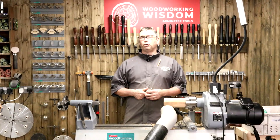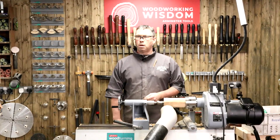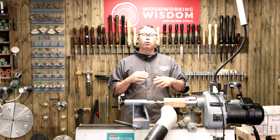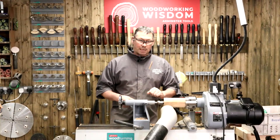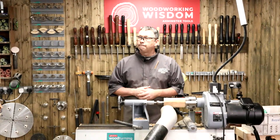Fuller is asking whether the chuck and bit wobbling will self-correct when boring starts. Yes - what we're going to do now is bore with that hole as our centre and then turn around that centre, so that becomes the new good centre. You can see I've put it back in the chuck and it's matching up really nicely - it has self-centred itself. If it hadn't, I'd slacken the chuck off, line the hole up onto the mill drill, then tighten the chuck back up again.